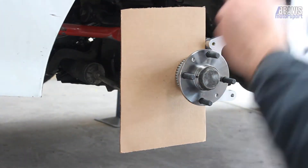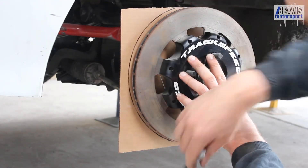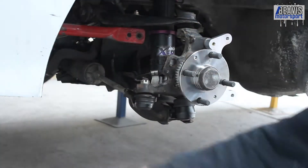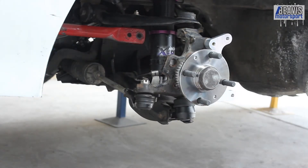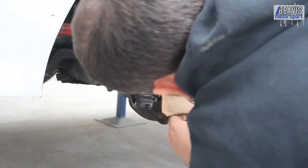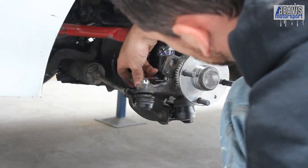I'm just trying to mock things up here, using the cardboard to identify where things fit and where they don't, where we might or might not have some clearance issues, and likewise what I might need to cut out of the way to get these to work. You can quickly see here, as I trim things down, that things start to come together. I need to make some clearance for the steering ball joint, and I've also bent the top and bottom over, with the theory of creating a duct to sort of perhaps scoop air into the rotor. Now the OEM dust shield usually bolts in here with three bolts, and there's also a hole required for the ABS sensor. So I'll mark those out, and if I get them lined up correctly, I'll be able to bolt my duct down to the OEM location.